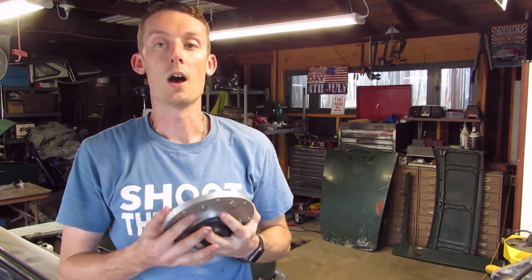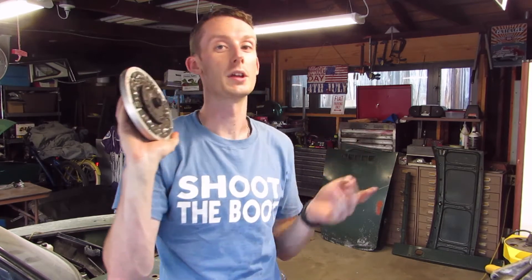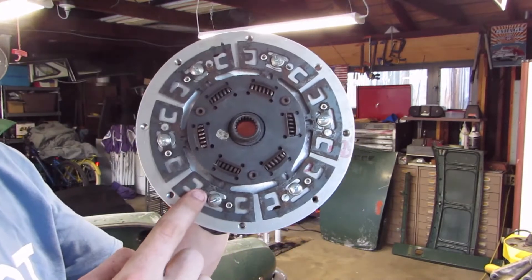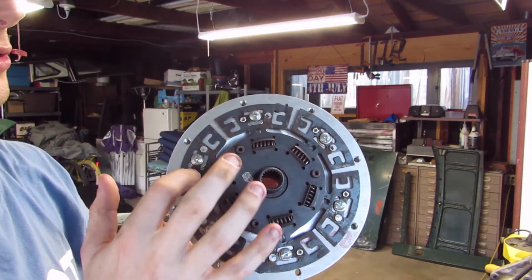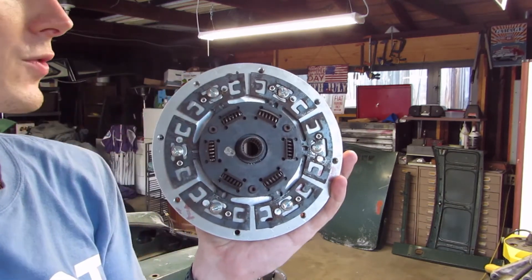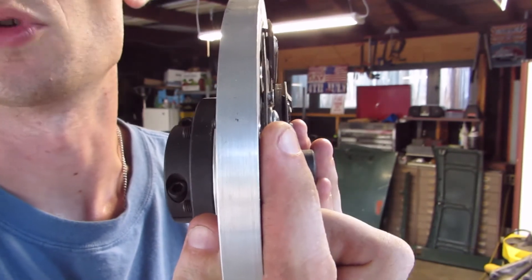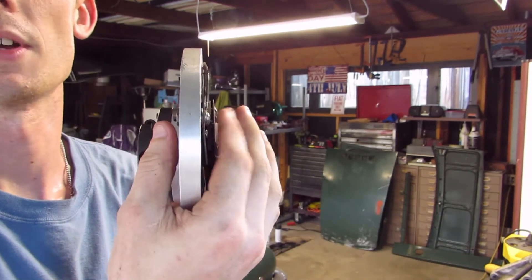Before I keep going I wanted to show you all my coupler. If you follow me on Instagram at 850_EV_project, you'll see this is up with the transmission adapter plate. So this is the old clutch that was on the internal combustion engine. I took off all the texture here to get to these little gaps, and I was able to drill holes through this aluminum coupler and thread those holes — so these are gripping all the way through and go all the way through the plate. I have a washer underneath to match up with the surface so they're not completely pressed and squeezed, which keeps it kind of central.